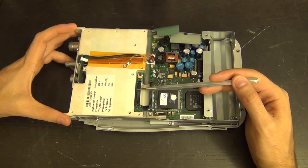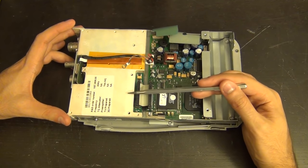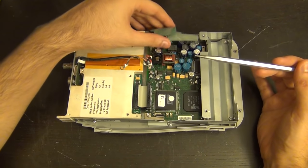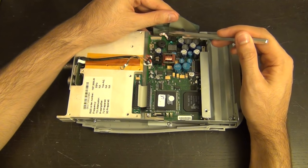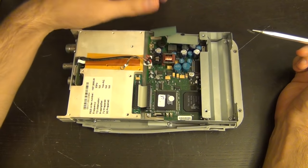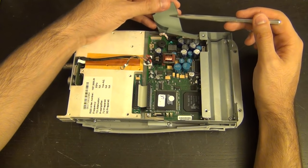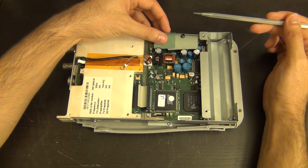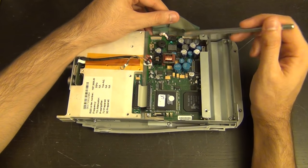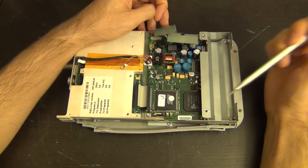This RF section is screwed shut, of course. Looking at this cable, I would say even the analog-to-digital conversion is most likely completed inside that section - they send digital data over. I don't believe they send any analog data, but I'd need to open it to know for sure. Here's the backlight connector. I took out the LCD cable while removing the aluminum to make sure I didn't damage it. Here's the ribbon cable that goes to the keyboard.